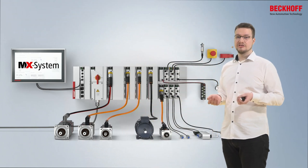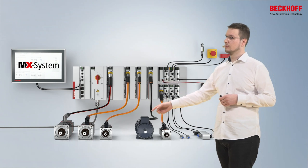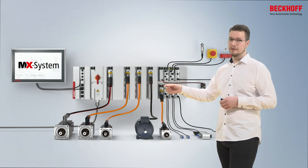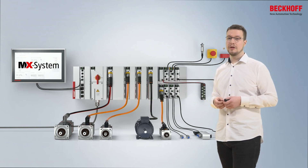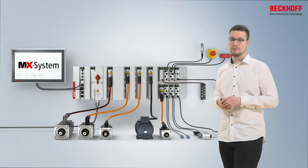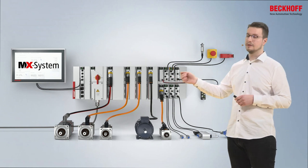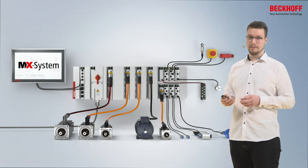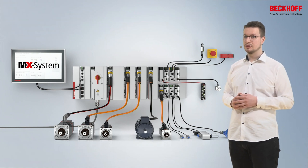If we now take a look at the MX system with sensors and actuators connected, you can see a direct connection from the functional module to, in this case, an AC motor. The whole functionality of connecting the AC motor is covered within one single module – it has the motor circuit breaker, functional safety built in, the motor starter itself, and even EtherCAT communication to diagnose the motor, for example with temperature, and to run the motor. Same for IO modules – here an encoder is directly connected to a corresponding IO module, which houses the fusing and protection of the sensor. The power supply is directly connected to the sensor from the backplane.